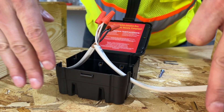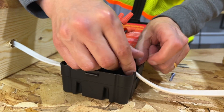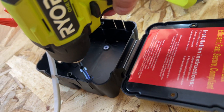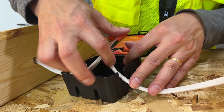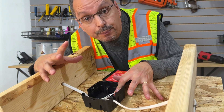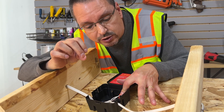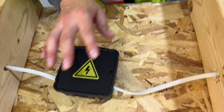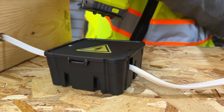You could install a new 2x4 if you needed to mount it in this orientation, just depending on how much room you have to move the wire splice around. In this case, we can mount it right down to the subfloor. With your junction box firmly installed, simply fold the electrical splice in. This is the unsafe condition — a splice is the weak spot in all your circuits. If that were to short out or become loose, a fire could start. And believe it or not, you're 80% done. You're literally going to close up your safe junction box and, with the provided screws, close it on down.